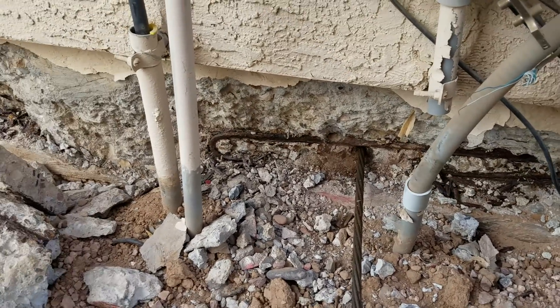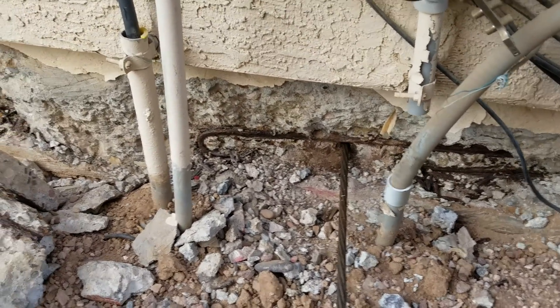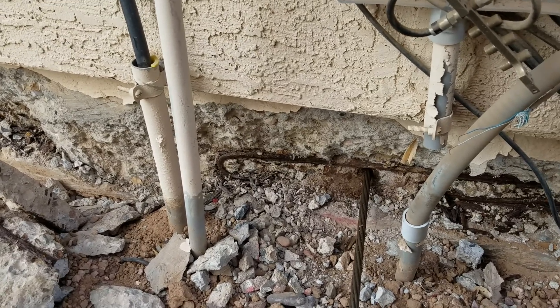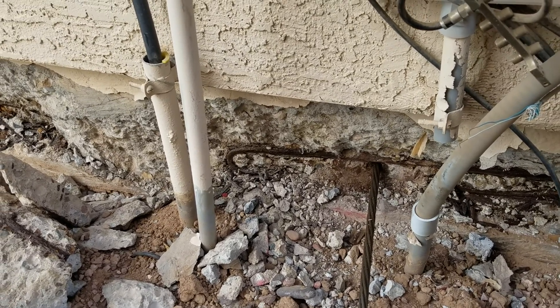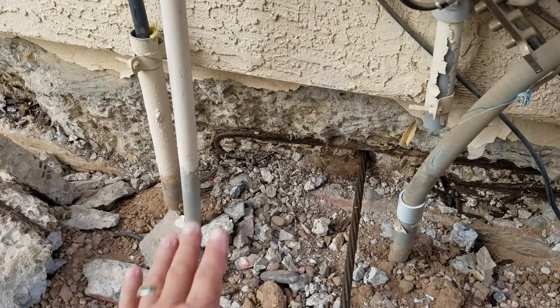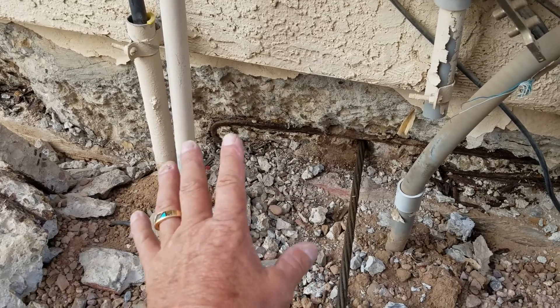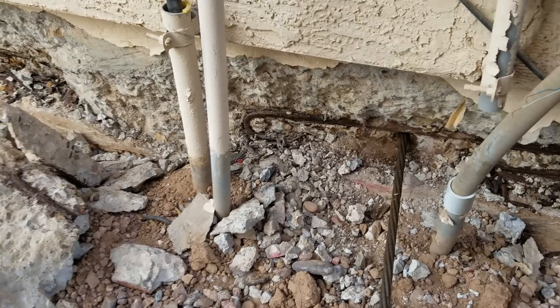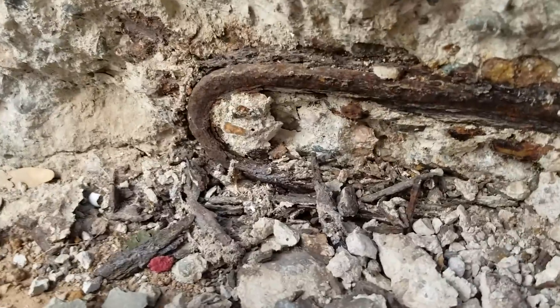This is what's going on in Arizona, folks. Take a moment — if you have a post-tension foundation, walk around your house. Make sure that you have rain gutters and that the downspouts go away from the home. Dirt grading — those are the two best methods to slow or even stop this corrosion of the reinforcement bar that we're seeing here.